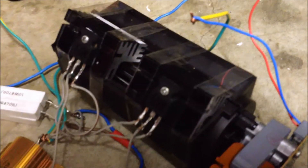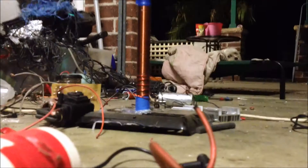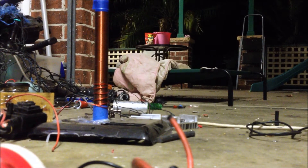That goes through a 25-ohm resistor to negative. I've halved the resistance to each gate or base, and I get no transistor heat. I mean, I am using a pretty cool cooling system I just made — two separate heat sinks into a little fan. It looks like a little microwave motor except it runs off 24 volts. 15 volts going into it — the whole driver is only running on 15 volts — and I get some pretty nice lights.